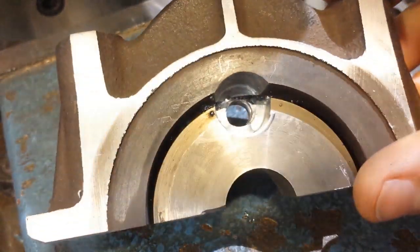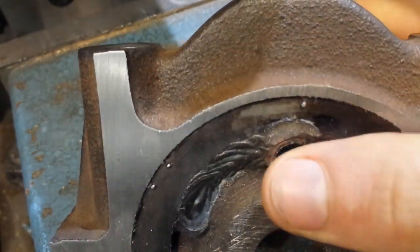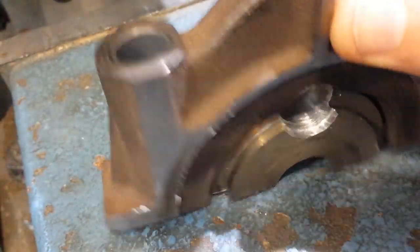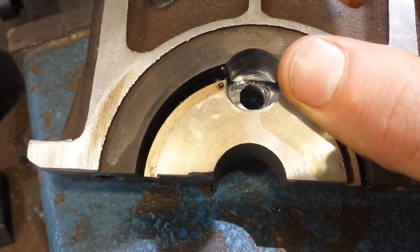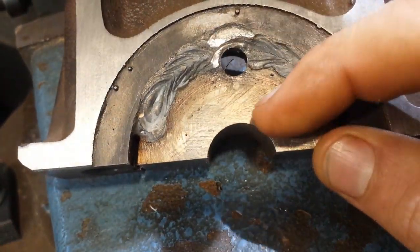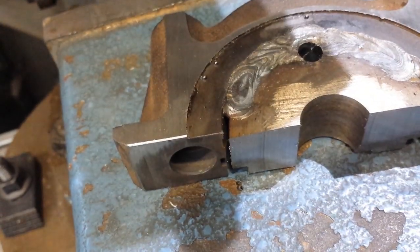So here's where we are. We've gone down to where the weld starts on that side. As soon as we get to that area, I've just about managed to get through there with a carbide drill bit — an 8mm one — but this needs to be a 16mm hole. I don't have any other carbide related tooling to get me through there, and everything's just blunting, getting munched up and rocking the machine all about the place. I don't know what's happened, whether it's interacted with the cast iron, the mild steel or the welding wire, but it seems to have created some kind of diamond-hard, impervious layer.